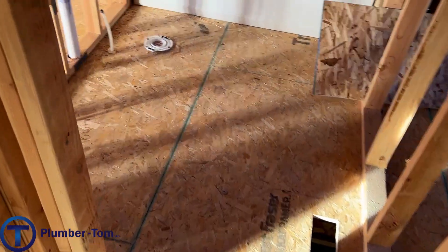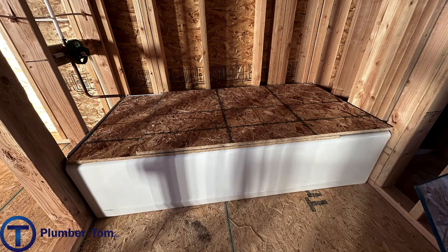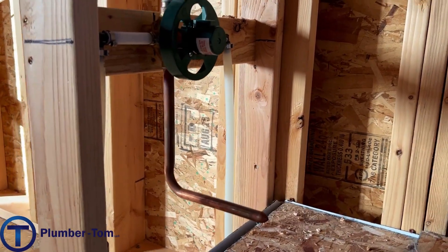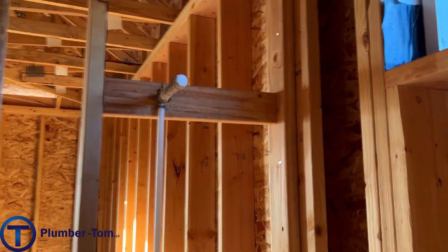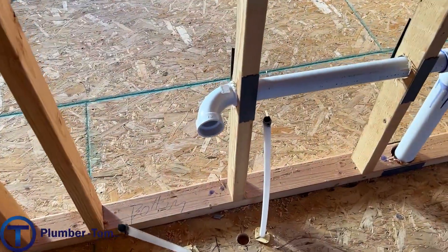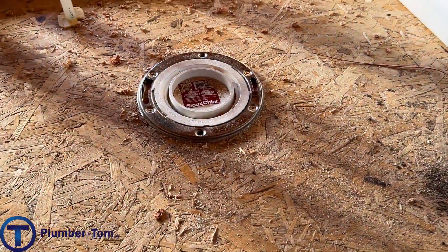Coming into the main floor bathroom — there's a lav, a toilet, and a tub. This plumber threw some OSB right over the top of the tub to protect it, since sheetrock people and others will just step all over it. Another Moen Posi-Temp with a tub stub 90 — a really quick way to do it. This is actually one of the pre-soldered ones you can buy from the manufacturer with PEX crimp on both sides, which makes installation really nice. Well-secured on the shower head, and a long sweep 90 — I like that. Again, I recommend plugging that up so no sewer gas comes out and no garbage goes in.